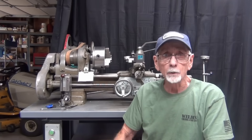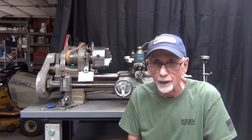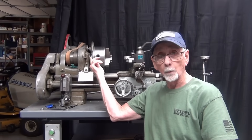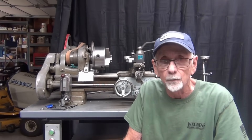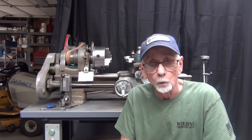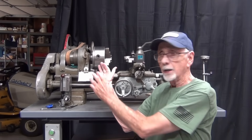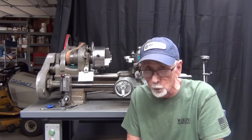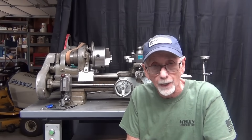What I'm going to do in this video: I'm going to go back and double-check the accuracy using a more accurate ground stock that's truly round and compare the two. Then I want to remove the chuck from the backing plate and counterbore those big cap screws that stick out — I find that quite objectionable, as some of you did as well. And then lastly, several of you said you can probably loosen up the backing plate and tap the chuck body around a little bit. I don't know how much clearance there is to do that, but I'll give it a try since I'm taking the backing plate off anyway to do the counterboring. So let's begin.